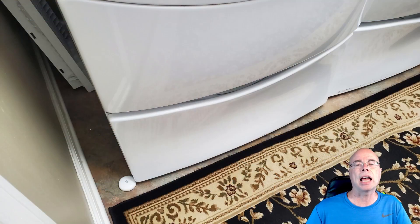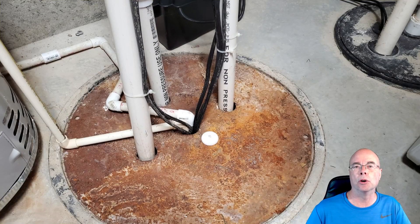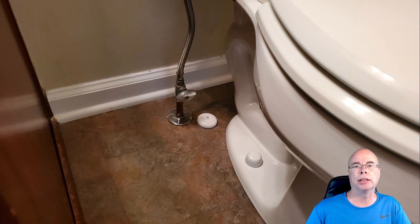There are other types of water and leak detectors available. Some of these detect leaks by actually measuring the pressure in your water pipes, and some will actually shut off your main water supply if a leak is detected. But those are quite a bit more expensive and often require some sort of modification to your existing plumbing system. These Aqara sensors, on the other hand, are only about $19 currently on Amazon, with an additional 10% coupon available. It took me about 30 minutes from start to finish including writing the Home Assistant automation for the first one, and each one added since has only taken about 10 minutes. It doesn't require any modifications to your plumbing. Since adding the first one to cover my washer and one to the mechanical room, I've now added a leak detector next to every toilet and under every sink in the house.